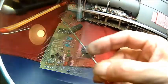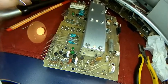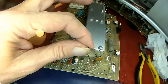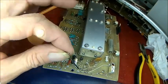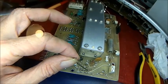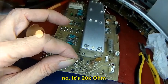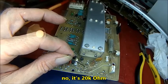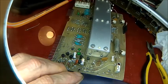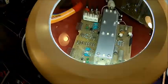Just for the sake of ruling out any shorts, we're going to pull the shaft out and lift that out. I'm on the magnifying glass and I did some markings here. So this is the normally closed switch — normally closed means indent, that's fully clockwise. Normally open, this is the wiper, that's clockwise, and this is anti-clockwise. So fully clockwise to wiper: this is 10K, and this is a short — that's what we need to make. And obviously we need to make a short here as well. That should fix our problem, at least for now.